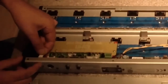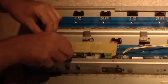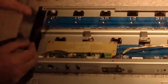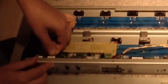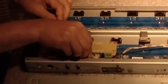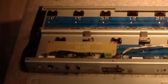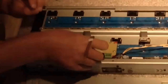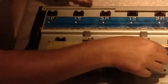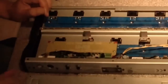What's next? A few cables. The first one is connecting the USB from the connector to the main board. Don't worry, you can't put them in the wrong direction — it's just one choice. Same for the next cable, which carries MIDI-in, MIDI-out, and phantom power, if you use phantom power. And then next to this eight-pins connector, we have a four-pins connector, which we use for the last long cable. Here you have to pay attention, because there are two four-pins connectors on the main board. Use the one next to the eight-pins connector. At the other end, we plug this cable into the FCB-1010 board, where we unplugged the original MIDI connector board.